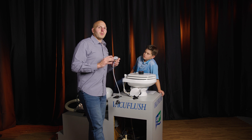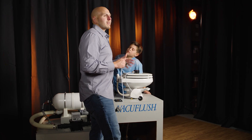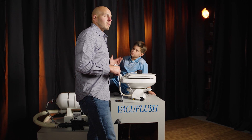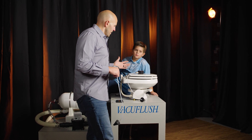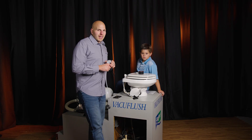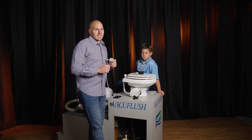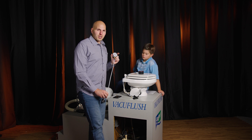So you're having some trouble with your vacuum flush system. You've gone through a couple of the basic service issues — you did the duckbill valves — and the pump is still cycling frequently. A vacuum tester gauge is a very useful tool for isolating leaks. This here is the analog gauge.